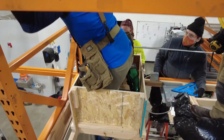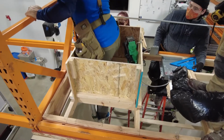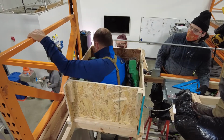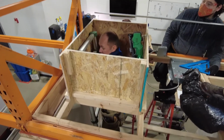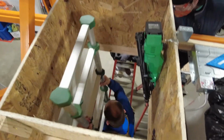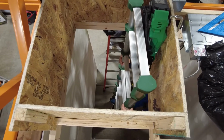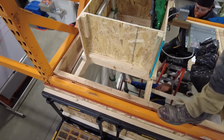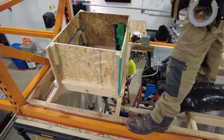Come down ladders. I just did the wrong thing. You always face the ladder, because if you fall, you can grab the ladder. If you're going the other way and you fall, you go straight forward. And if it's a situation like this, it's like you saw Bill do. It kind of goes like this. Just hold the ladder. You're not going to fall. Right. It's not going to go anywhere. You might get a little startled, but don't let go of the ladder. Okay, no matter what.